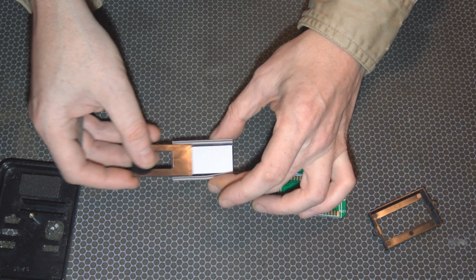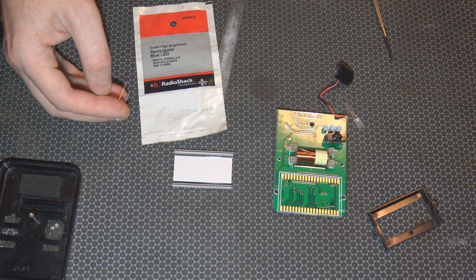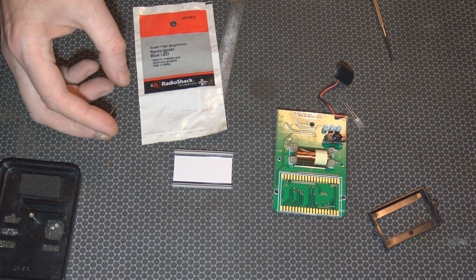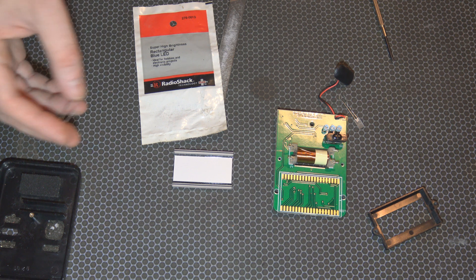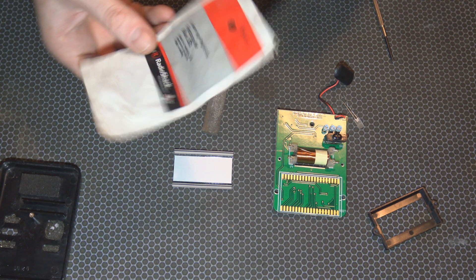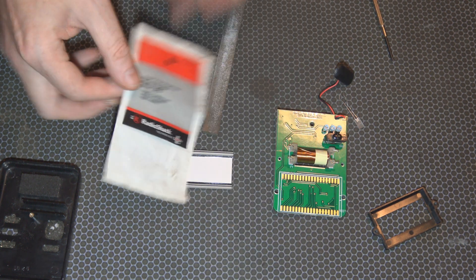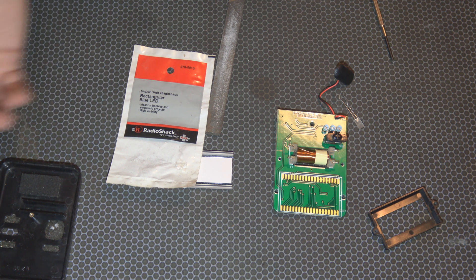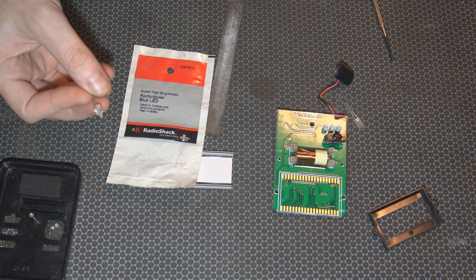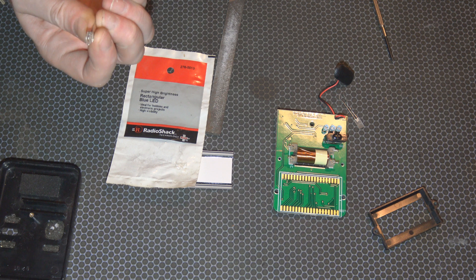We've got this little black piece of plastic which doesn't really need to be there. I'm not going to go into the maths to calculate the current limiting resistor — I've done that in another video, you can use an online calculator. If you use these exact ones, 180 ohms is what you need, or more, as long as it still lights up.